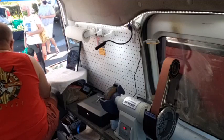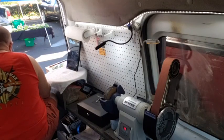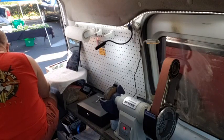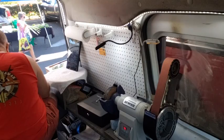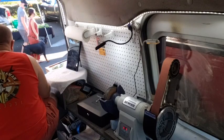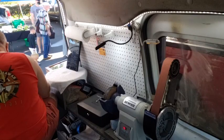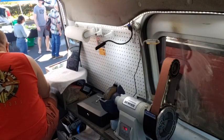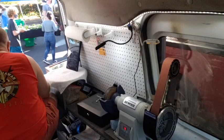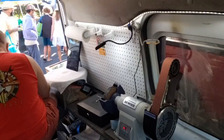I did that with a belt progression. And then you'll watch, I pull it up. That's a mirror polish. Maybe this one will actually pull up. Man, that's beautiful. Why did you do that with my blade? Because it's about gaining the competency. When I pull it up and you look straight down, it's beautiful. It was a 6-step process, and I finished with a polish belt. And then of course you can sharpen and put a little micro bevel or whatever you want. But it's flat.